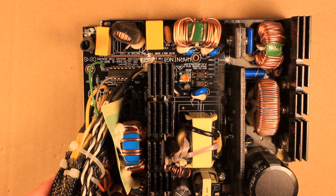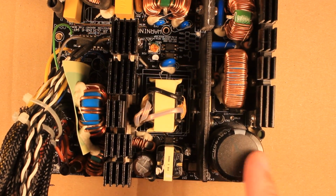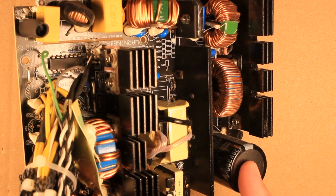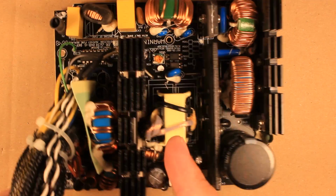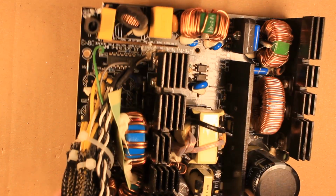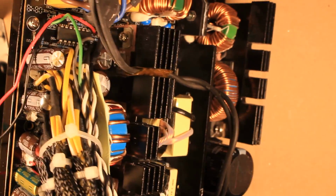And that means that I'm definitely going to replace all these El Cheapo, or El TAPO, filtering capacitors. To repair this thing, I removed most of the capacitors except the main bulk filtering capacitor, because I didn't find such a relatively high value. I have 220 microfarad capacitors, but those are definitely smaller. As you see on the board, in some of the places I actually started to replace the capacitors. So the next stage is to replace them all, except the bulk main filtering capacitor.